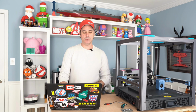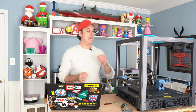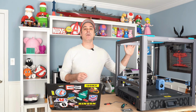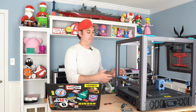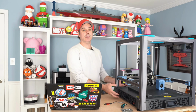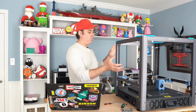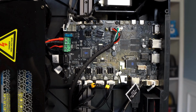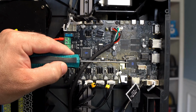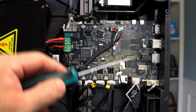So once you've done that and you have those credentials entered, we're ready to eject that USB boot device, and then we can pull off the eMMC and put that right back in our printer. And you're going to do that following the same steps that I showed you on how to remove it. So put this thing on its back again. If you haven't already done so, I flipped mine back over, but put it back on its back, and when you're looking at it, orientation, you want the longer part of the eMMC pointing down if you're doing it this way. So this guy will flip back like this, and then make sure the eMMC is pointing down, and you'll be good to go.